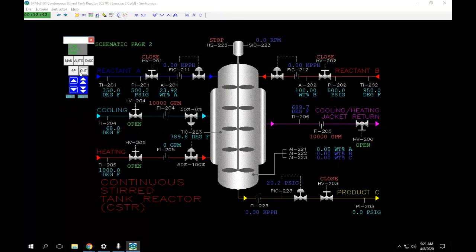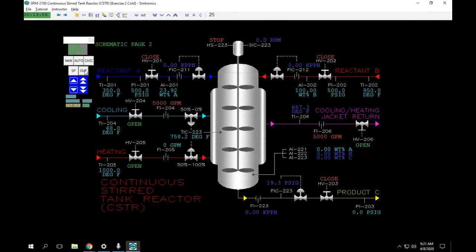And then if we keep going on this same side, this can control anywhere from 4 to 12 milliamps. So right now we're at 8 milliamps or 25%, which is this transducer halfway. This transducer is calibrated between 4 and 12 milliamps. So instead of running it through the whole range of 4 to 20, we go 4 to 12, 4 being fully open and 12 being fully closed.